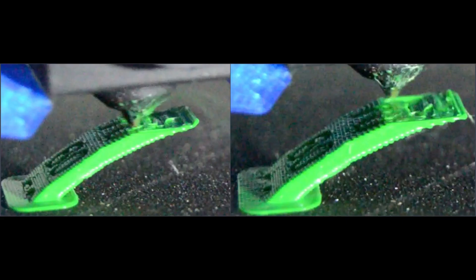So what is overhang? While the filament is laid mid-air, i.e. there isn't any previous layer or filament or some kind of support underneath while it is printing, and it is not bridging between two points, that is called overhang printing. As you can see in this picture, the nozzle will start to print from this position, travel here, then make the travel move here and then over here. While it is printing in this area there isn't anything beneath it to support, so this is called overhang printing.